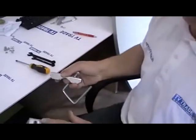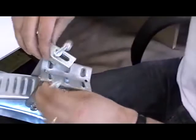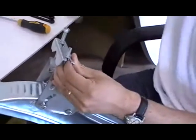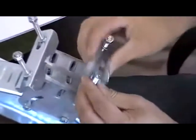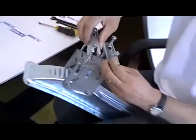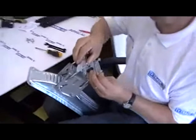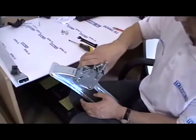Now we have the actual brackets that are sloping, with a total of three holes. We're going to use U-bolts into the top and bottom holes, which will be used to attach the dish onto a pole. We rotate this around and drop it into position, then add a washer and a nut, tightening it manually initially. We repeat the process with the next U-bolt, sliding it down into position with washer and nut. When the dish is fully assembled, we slot this over a one or two inch pole and tighten it to lock position. These nuts will eventually be tightened to lock the dish at the final angle.